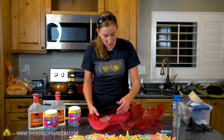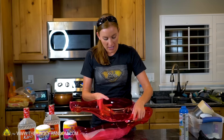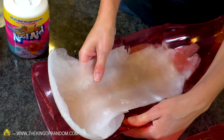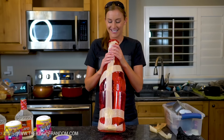I've got the water running and several pounds of ice in the sink right now, so we're going to have an ice bath going so when I start filling up these two sides we can just be dunking them and cooling as we go. The side that we didn't spray down definitely stuck, but we were also seeing that pouring in layers wasn't working very well. The one that I did put a bit of a release agent in — once we get enough layers and it's thick enough, that's going to work. So I'm going to melt this back down, clean up both sides, tape them together, and start again. This doesn't feel very stable, because it's not, and I'm banking on the fact that the wax itself is going to help seal this together as I pour.